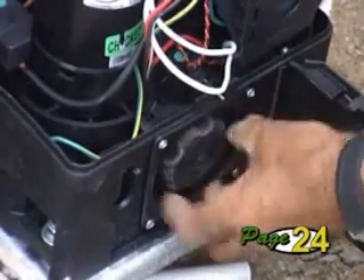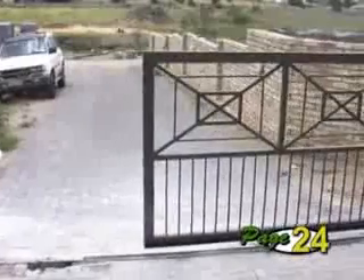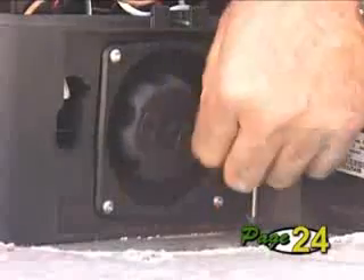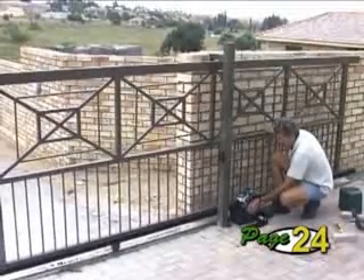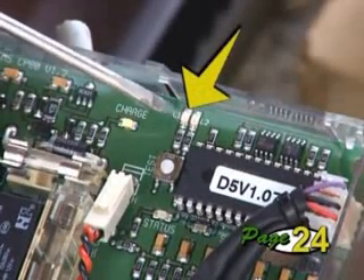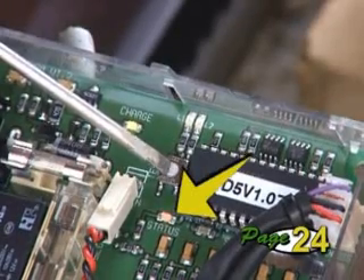The next stage is to disengage the manual override. To do this, turn the thumb wheel fully clockwise until the gate can be moved by hand. Now slide the gate approximately halfway open. Re-engage the drive by turning the thumb wheel anti-clockwise as much as possible, just short of not being able to close the manual override door. Slide the gate slightly until the drive locks with an audible click. To start the automatic setup routine, press the test button for one flash of LED L1 and then release. Then press and hold the test button until the status LED comes on. When it does, release the test button to begin the automatic setup.